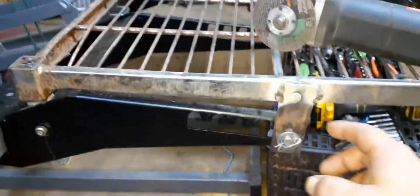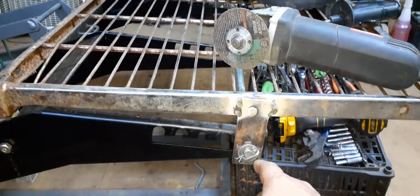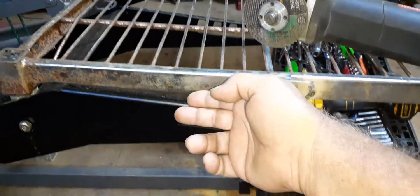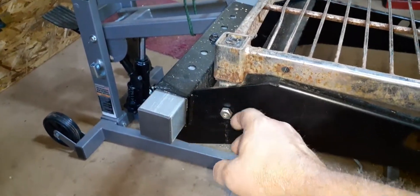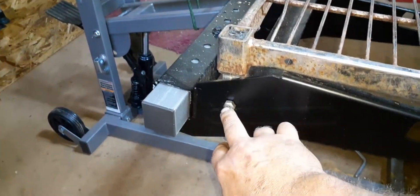So, I drilled this, put a bolt in it, plus I welded it, and I used the pin that goes across there to adjust for the tire onto it, and then over here I drilled through the bar that came down for the leg that used to be there. I drilled through it and I put a bolt through that.